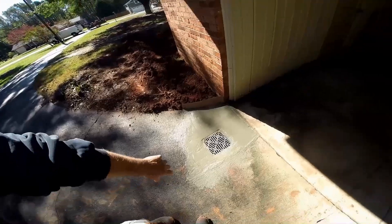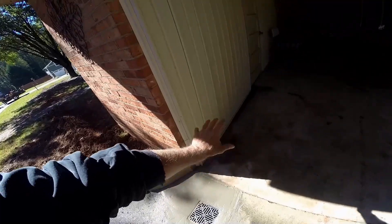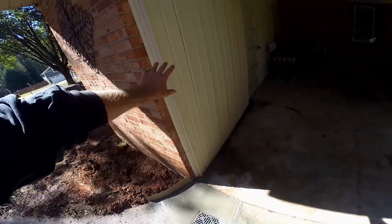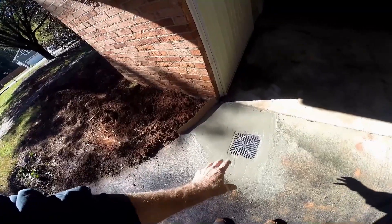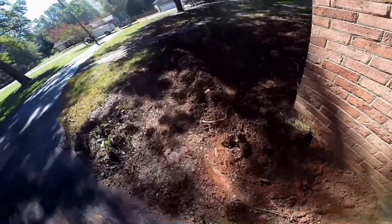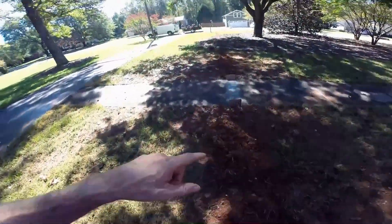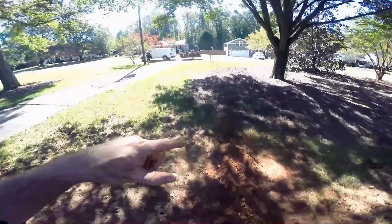Let's recap what had been happening here. Water was coming down this driveway, turning and flooding into this carport, and destroying the wood inside that shed. So we put in a catch basin — we cut the driveway, put in a catch basin, new pipe comes out, picks up the downspout, all the way out, cut the walk, and goes all the way out.